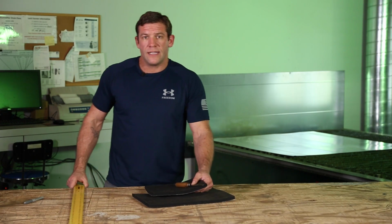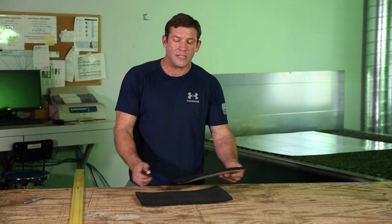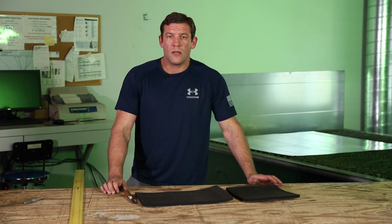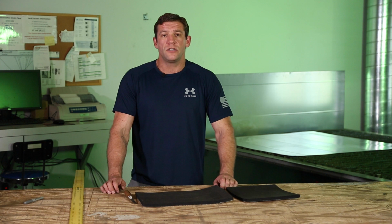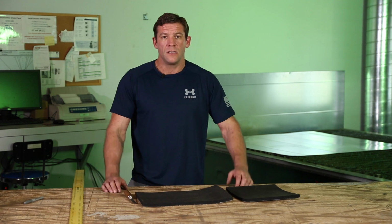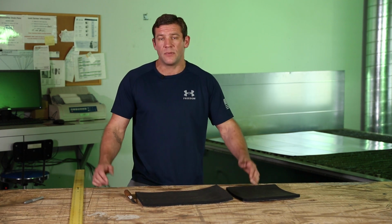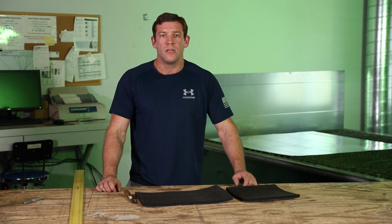Another thing I want to touch on is when do we use round pipe, when do we use rectangular duct? Well, that is all application based. A couple things that you just need to remember: if you're making turns with round pipe, it is very difficult to internally line round pipe elbows. We've made pattern sets here that give us templates for lining round pipe elbows. Armaflex actually has these templates you can order from them, but they come in paper and that's hard to reuse.